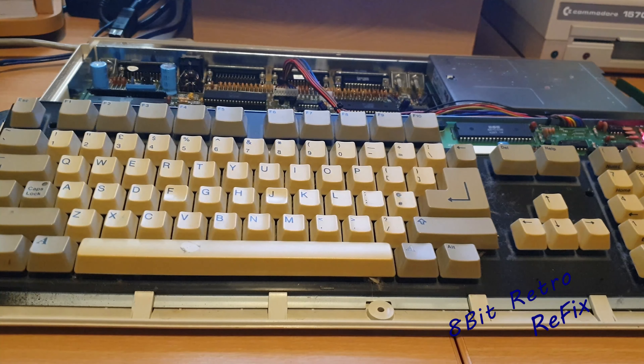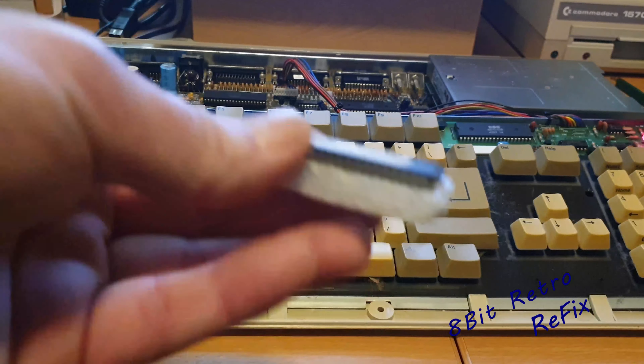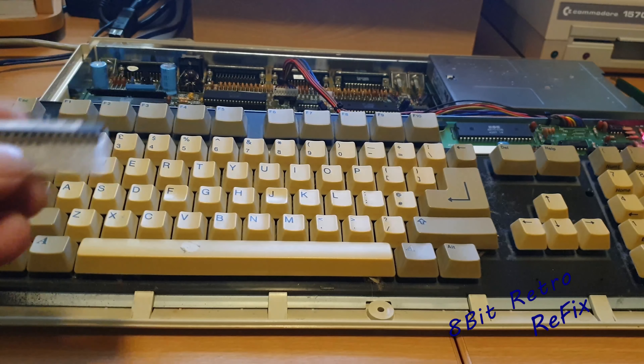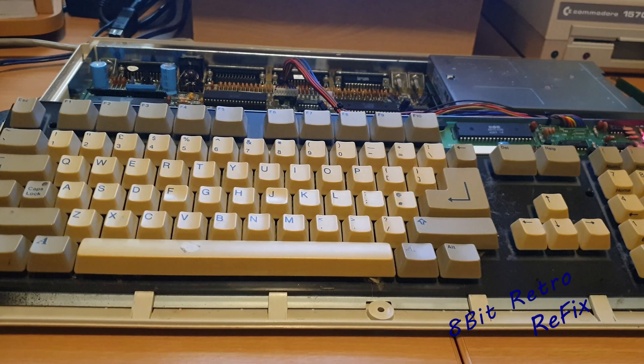So we're back at the faulty machine. I've put the two CIA chips in from the other one — that's the bad one we were dealing with — so now let's flip that switch and see what happens. Wow, it's just come on properly — we've got a power light coming on, which it didn't on the other one. We've got version 1.3 there. So while we've got it booting, I took an EPROM burner and created an Amiga A500 diagnostic ROM — I'm just going to pull the Kickstart ROM out and see if diagnostics will run on this system.